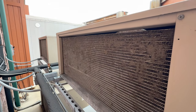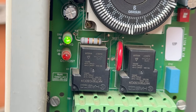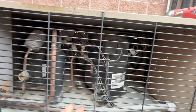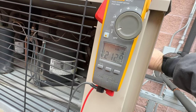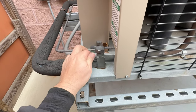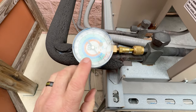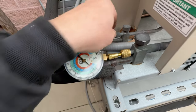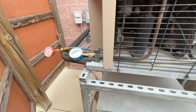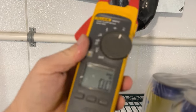Not running well, a little dirty inside. We've got a green light so that's good. Contactor's not holding - that's bad. I bet our pressure switches are the issue - that's about the only safety besides the high pressure. Let's pop that cover and take a peek. We've got a pressure issue - solenoid not working, or what's going on? Let's see what our suction pressure is. Sight glass looks like it's liquidy in there - that can be deceiving though. We've got about 3-4 pounds on the suction side and around 105-110 pounds on the high side. I swear that solenoid valve feels like it's powered - let me grab the amp meter and see if it's got amperage.